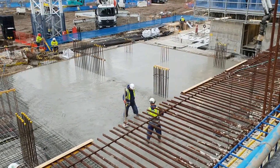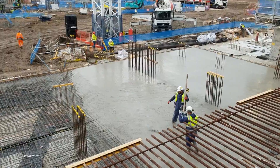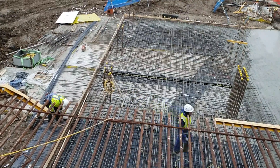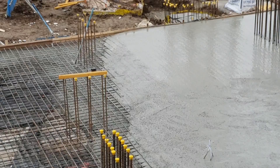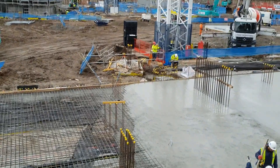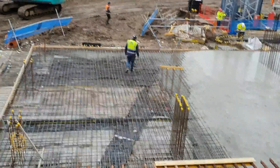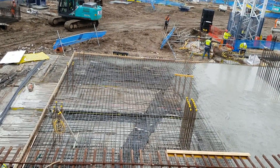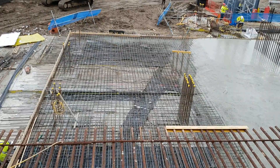As I said before, once the slab is poured, as you can see here, the next day your job is to quickly mark the lines and get everything ready for the fixers and the chippies. You can see one chippy is finishing the stop end here - there are enough splice bars for the next pour. You can see there's a lightning protection cable there, as used before in the capping beam, and there's a drainage pipe sticking out - a drainage connection. I'm going to show you that in a separate video. You can see the small manhole behind it to be connected with the slab - drainage is a big part of the job and really needs more time to look at the drawings.